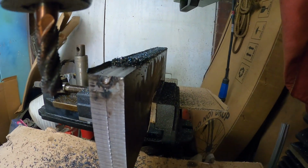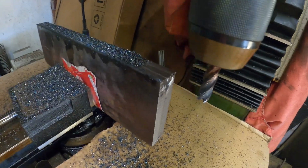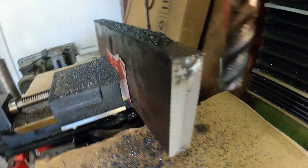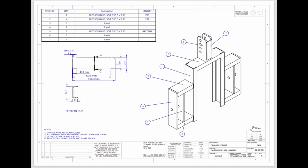I have now machined that as good as I can to get it usable, and it's 1.2mm under minimum size now, which we can still work with, but to get an achievable workable finish, we have had to take on this end 4mm off it, because that's how much kerf Forklift's plasma cutter puts on. Whether that's a CNC or whether that is human error, I don't know, but they had the engineer drawings and they were toleranced within 2mm, so they had 125 to 127, and they've come in at massively over on the top and massively under on the bottom with the undercut. So I won't be using Forklift for plasma cutting anymore. Definitely not.